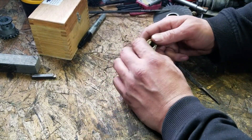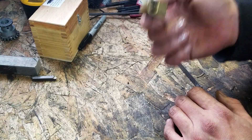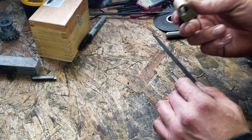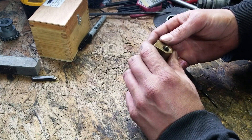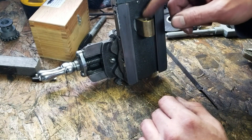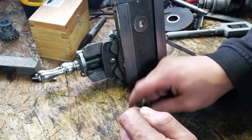What's up folks? Another fine stormy day in rural Saskatchewan today. I was giving my top slide a little bit of some TLC. When I bought this lathe it came with some junk - that die holder, my aforementioned die holder, and there's another cross feed nut in there. However, this is most likely off of a 10F series which is a more popular series, but it has like zero slop in there - it's really nice. I'm thinking that'll eliminate pretty much all of the backlash in my compound, so it's pretty hard to pass that up. Let's head over to the lathe.